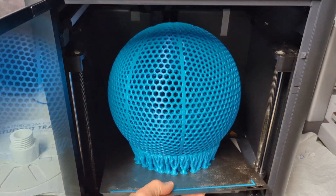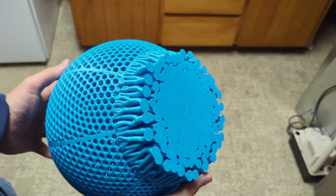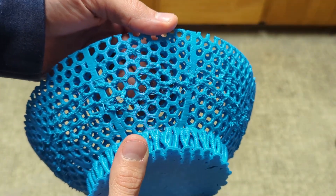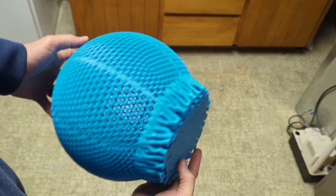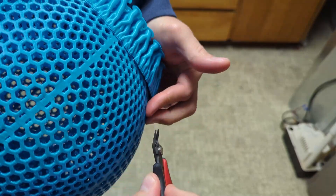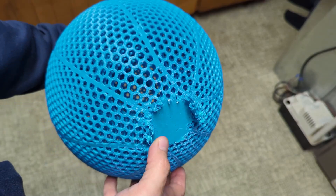I then printed the basketball model I designed for this filament. I had to add quite a bit of extra support material because my printer was having issues with overhangs, but after adding the extra support the print came out really clean. I'm still figuring out ideal support settings — I heard setting the Z distance between the interface and the basketball to 0.28 or 0.3 mm really helps with support removal, so I'll be testing that. There was still a little left on the bottom requiring the angle grinder again.